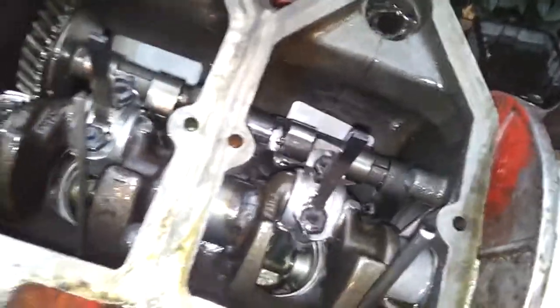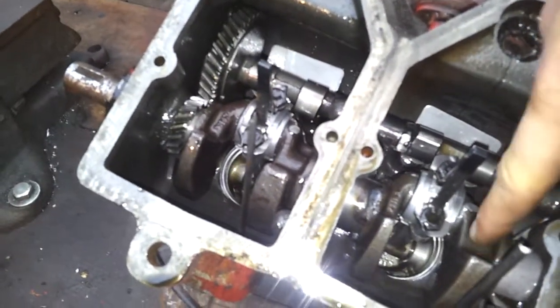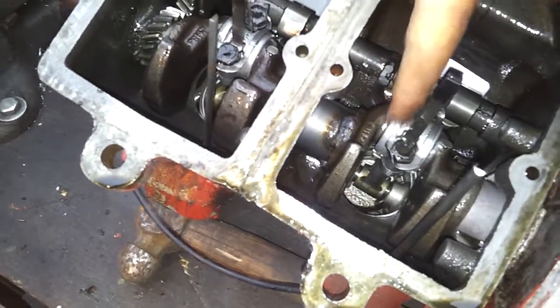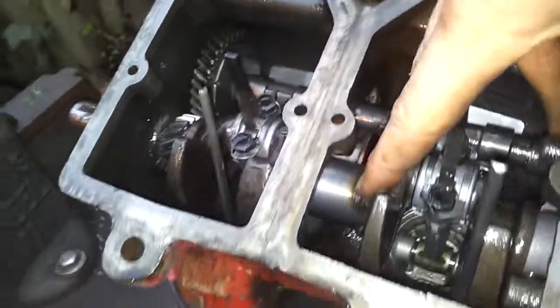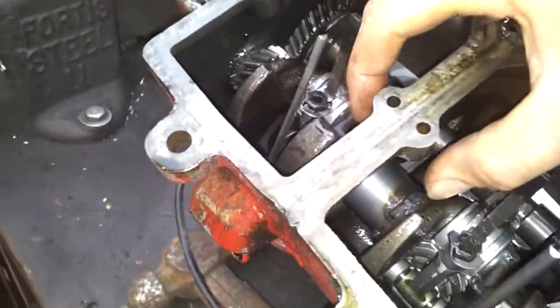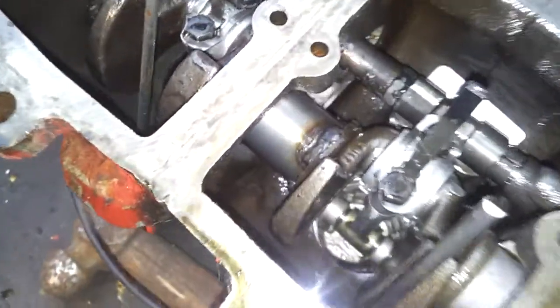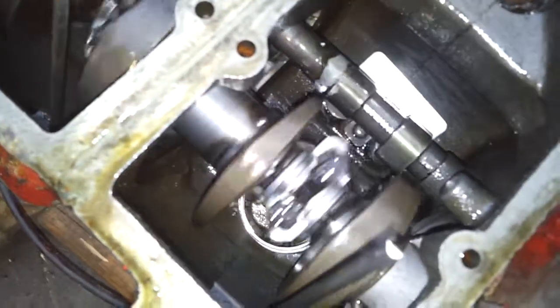For the crankshafts — this back one here — I put the crankshaft in the lathe and turned off the gear that's there, bringing it back to about 15 mm or so. Then I made up a spacer to go in between, about 35 mm long with a three-quarter inch hole, roughly. That seemed to work. It's not even welded all the way around — I was a bit worried about bending it, but it's still bent anyway.